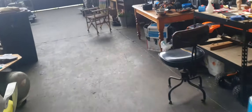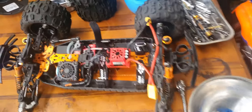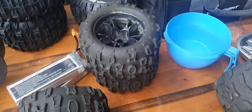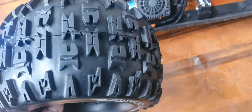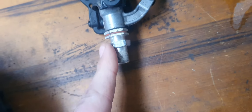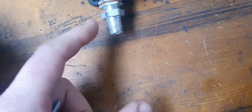I just got to work and I'm messing around with this RC car, putting these bigger wheels on it — taking these ones off, putting these ones on. But to fit these on, they're too close to the body, so I have to pull this piece off. It's aluminium. I need to make another one of these — get some 17mm hexagon bar, make one about this long, and put the thread up here.